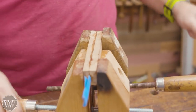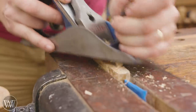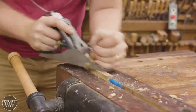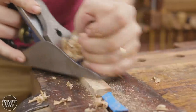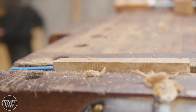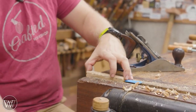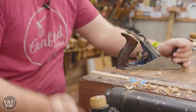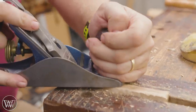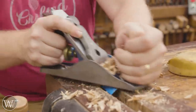So now with the magic of editing, it is done. We can take it apart and start doing some of the finish work. First thing I want to do is get a reference surface on the joint and make sure the joint is nice and tight. With live oak there was a little bit of chipping — a few spots that aren't amazing, but that's just part of live oak. There are gaps and voids in live oak; it's not a perfectly smooth solid surface. We're going to joint all four sides so we end up with a smooth surface on all four sides. Once I get all four sides smooth, I'm going to start tapering them — slightly thinner up by the tip and thicker by the bottom.